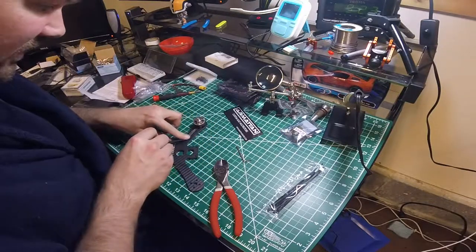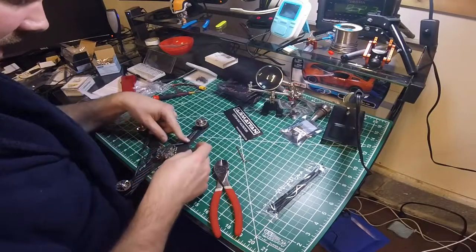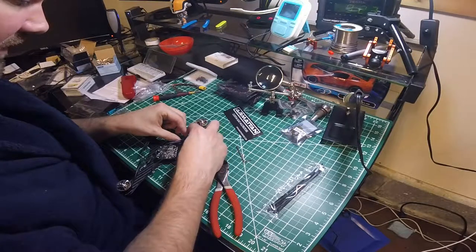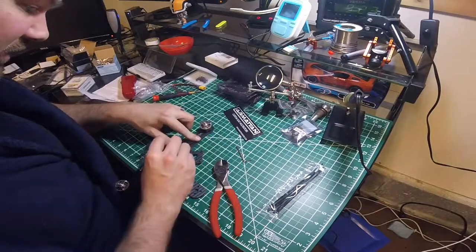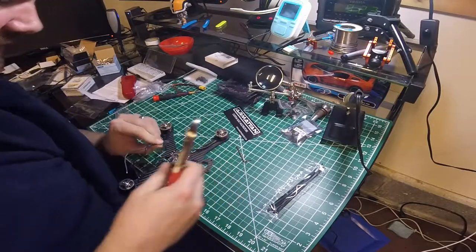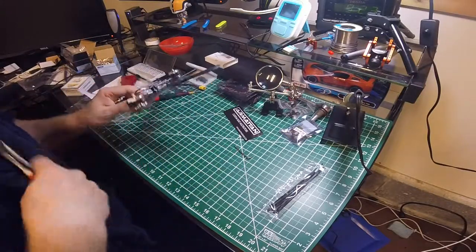And like I said, ultimately the wires are really only going to be about an inch or two, if that, because I'm going to mount the ESCs, and these are just going to get soldered right into the ESCs, so there's really not going to be a lot of wire on these. If I cut it way out here, this is probably triple or quadruple what I'm ultimately going to need, but it just makes it so that when I'm flipping this thing around, I don't have wires going all over the place